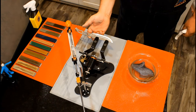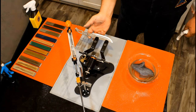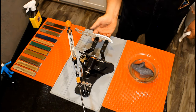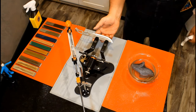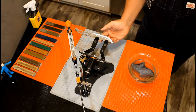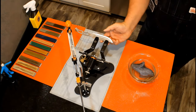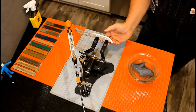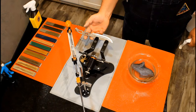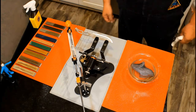If there is a spot, or multiple spots, where the burr is not formed, take a mental note of where they are on the blade. If you find a spot without the burr, do 10 more passes. When you do this for the first time, you will probably have the urge to apply a lot of pressure. But there is no need for this. Fight the urge.